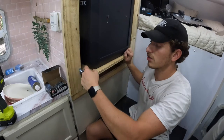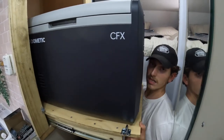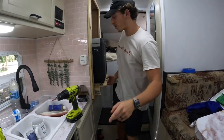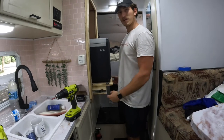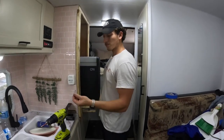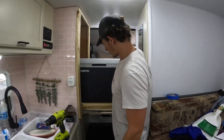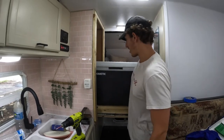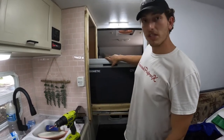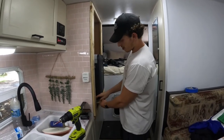It's actually pretty tough, surprisingly, with only two screws in it. This has to be sanded down so when I slide it out it slides all the way out. The screws that came with the drawer system — don't ever use those, they're not rated for anywhere near 100 pounds. We used one-and-a-quarter-inch framing screws and they work great. Now it slides all the way out — 20-inch slide — and it's going to probably sit about right there. Close it and lock it back in.